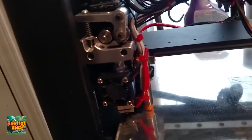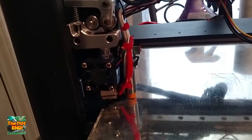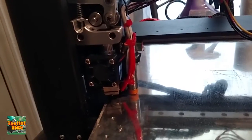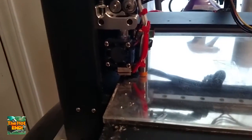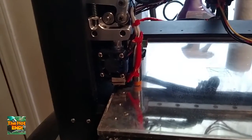The only thing you need to change if you have a Printerbot: Printerbots use a PNP sensor, which is not a sinking sensor and which Smoothie can't take. So we need to change that little orange sensor out for an NPN NC — NC stands for normally closed. That's pretty easy to do. That three-wire plug is wired in just to get signal and ground back on the board.